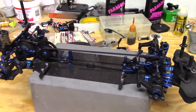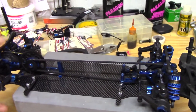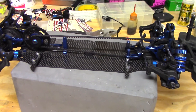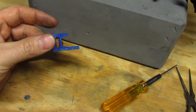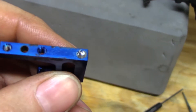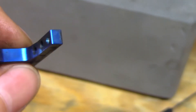Hey YouTube, I bought a used touring car and decided I wanted to clean it up. I've been taking screws out of the bottom and ran into one that was really tight. The head of the screw stripped out while I was taking this servo assembly out — the screw went up into this aluminum piece and stripped. So I drilled the head off, and now I need to get that little bit of steel screw out of this aluminum piece.